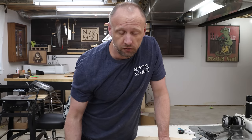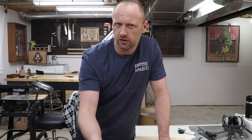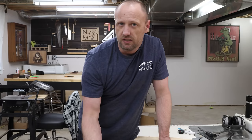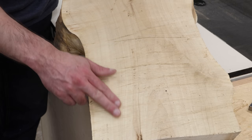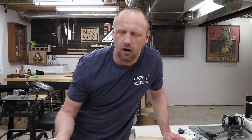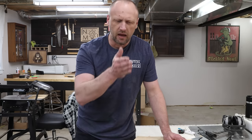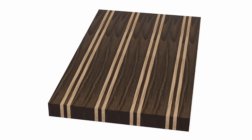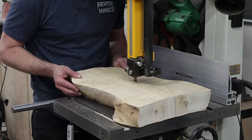Sort of making up this pattern on the fly. I've got my walnut and now I'm thinking having stripes within that walnut — maybe stripes within stripes. So I've got this thick piece of maple here, and typically I wouldn't cut up a big slab like this, but I really love this linear grain right down the sides. This particular piece of maple seems to be the right color. So I'm going to cut this into moderately thin pieces — walnut, then a piece of maple, then a thin piece of walnut, a piece of maple, then more walnut. We'll see how many I end up putting in this thing.